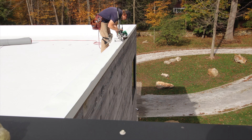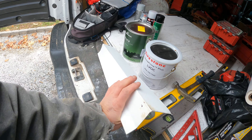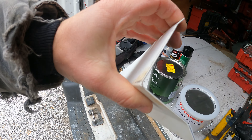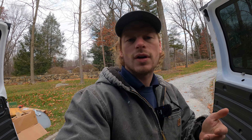We're doing it how the manufacturer recommends — using the best paint and the best primer there is. The reason I use TPO coated steel instead of aluminum drip edges is because I can actually weld directly to the drip edge. This is what it looks like when TPO coated steel is bent into a drip edge. That TPO is actually bonded to the drip edge, and that's a thousand percent better than using a peel-and-stick cover tape or some kind of membrane bending the material over. This is a thousand times better when providing a premium product.